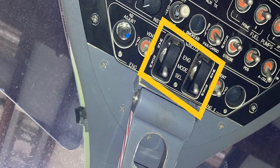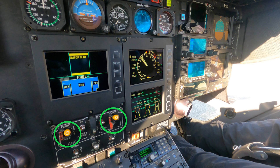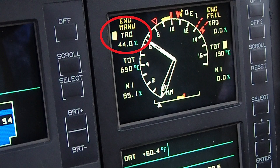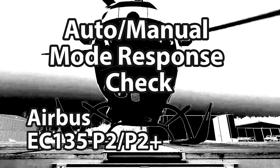That's it for the manual mode response check we do on the 200-hour engine inspections. It's pretty easy — make sure Ng is N1 on your screen, both engines in auto mode at flight idle until you do the check for each engine, switch to manual, don't jockey the throttles, and don't move the collective once stabilized at 85%. Write your numbers down — it will fluctuate just a tiny bit when you flip the switch, usually one to three percent plus or minus. If you see above five percent, you probably need a new FMM or your bearing housing is jammed with garbage. Thanks for watching.